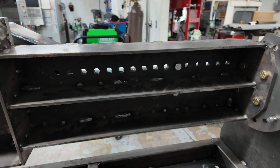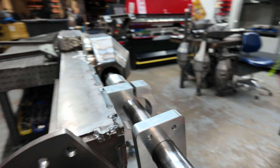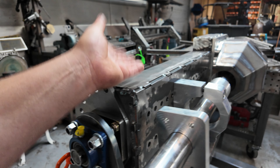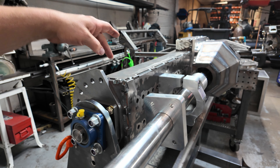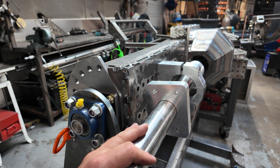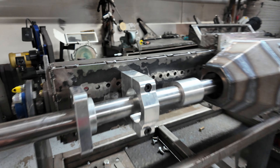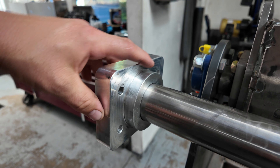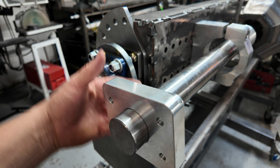I'd love to do this in aluminum someday, but my mill isn't big enough to do it in one go. We flipped this thing over, bolted it to the table, had clamps all the way across, and started welding up the tab and keys. You take the bar and roll across the top and it's within 10 thou — extremely flat. I machine these end caps for the big Ford that hold the billet in, and I left all this extra material on there so when welding the ends on you can put heat to it and pull some heat out.